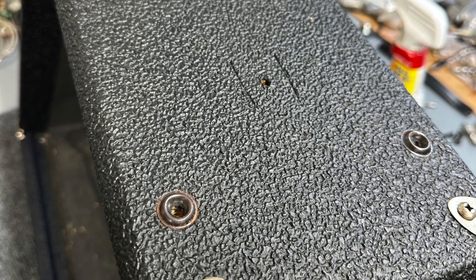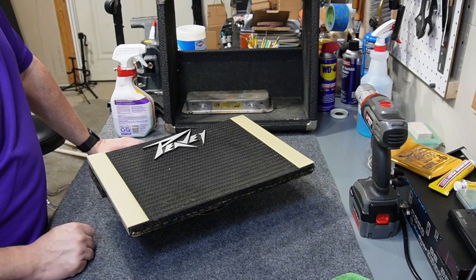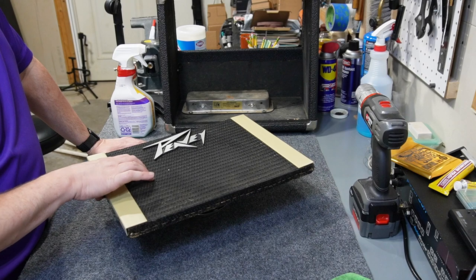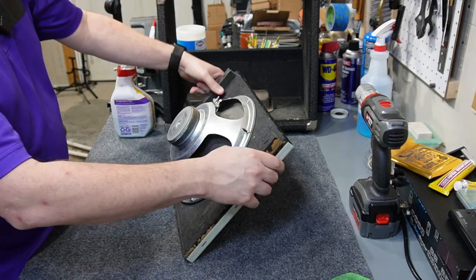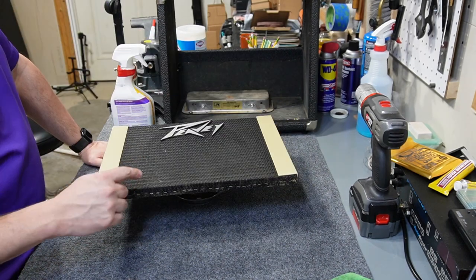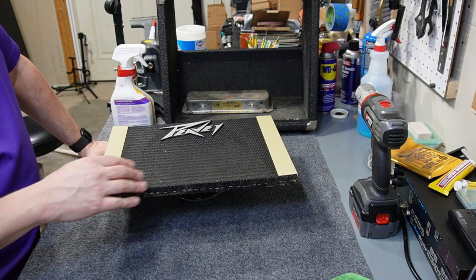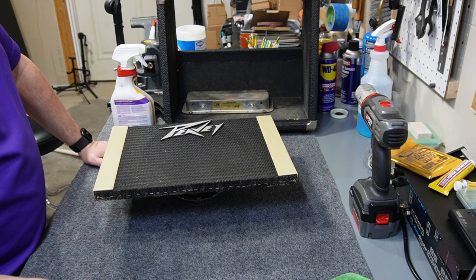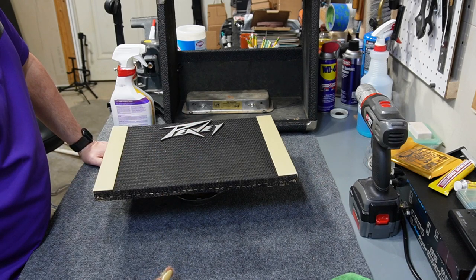I've started working on the baffle now. All I did was wipe the sides, but I've really got to get in here and clean this cloth. That's one of the hardest parts about cleaning up an amp like this, especially when it has a plywood baffle — I believe this one is OSB or something. You can't get it super wet. Start out with a toothbrush and a vacuum and just try to coax the dirt out. If that doesn't work, I'll get the cloth slightly wet with some degreaser, still vacuum it and that'll help out.